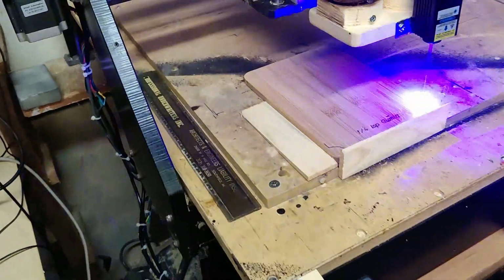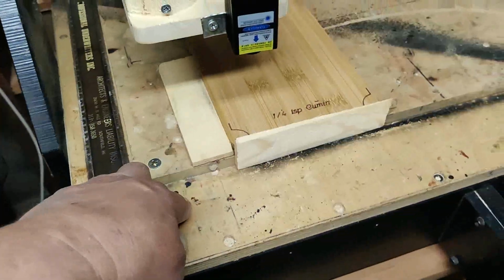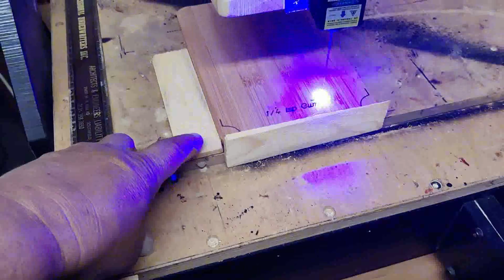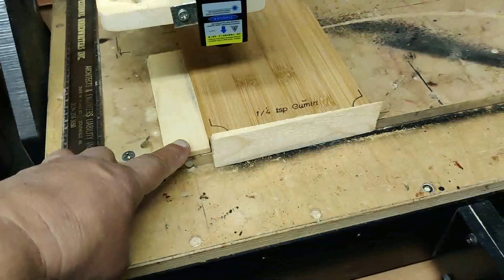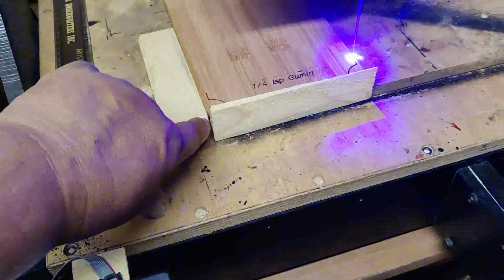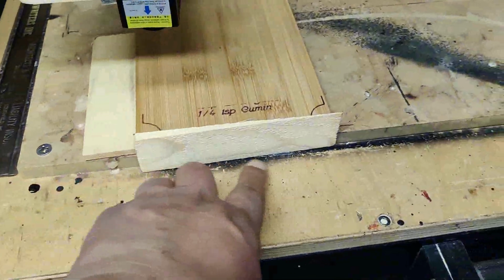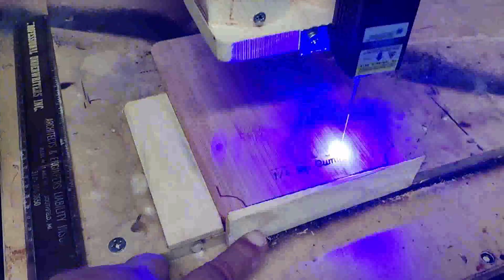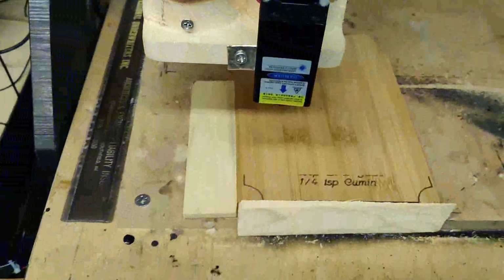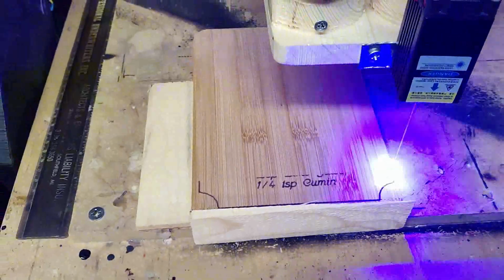I just wanted to show you a little something I did here on the CNC machine. This is called a temp jig. In other words, when I want to do a few of these different cutting boards right here, I just took some hot glue and glued up a couple of these shims here. Once I had the zero point set right there on the corner of that wood, I have not only my x-axis setting but my y-axis setting. Then all I need to do is set the Z, which is pretty easy, as I explained before.